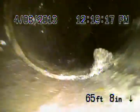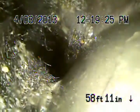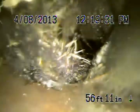It's going to transition pretty soon to 4-inch clay. That's from the house to the property line. The 4-inch clay has roots at every single coupling. Now we're coming onto the property — you can see there's roots here, and this is all 4-inch clay pipe.